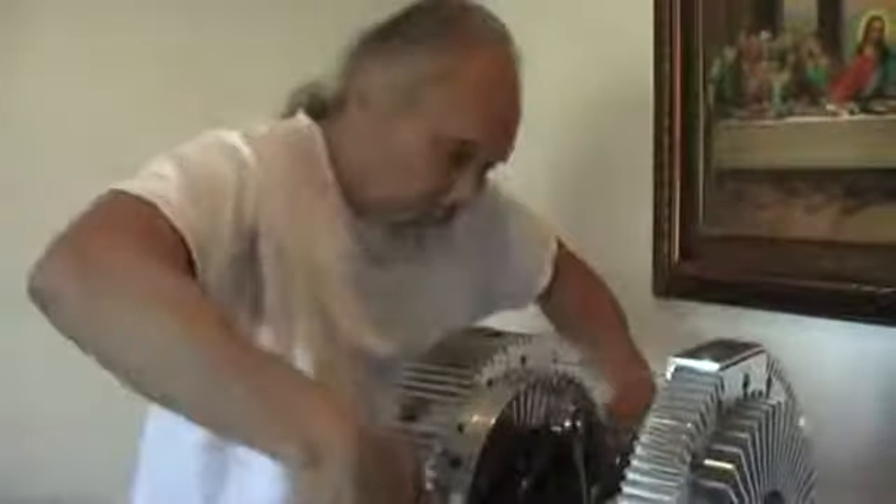The other half of this would encase the block. It's dry sump — there's no oil pan on the bottom. Oil is injected in with a power pump, comes out with a scavenge pump, and goes into a separate reservoir. Being dry sump means you can locate it lower for a lower center of gravity, making the car handle more stably. Since it's dry sump, you can orient it any which way — up, backwards, sideways, whatever — it's gravity independent.